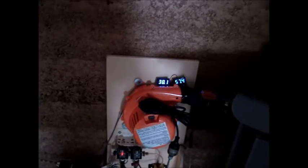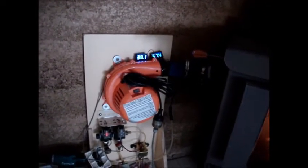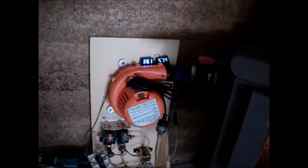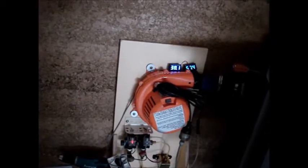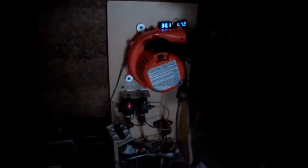Here we are on low flow rate. On the left, the solenoid has the red light on. I had an equipment failure here — the temperature sensor cut out of the return line, which is why the temperatures were relatively low on the return line. It's 38.1 now. You need just under 20 degrees C rise with the heat exchanger at the low flame rate. The fan's on the same speed as it was on the high flow rate.